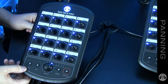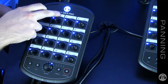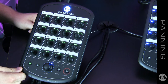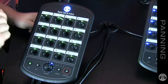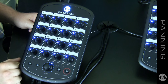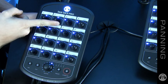The pan button on the Hearback Pro mixer serves two purposes. The first being stereo-linked pairs of channels — this can be done with adjacent channels such as 1 and 2, 3 and 4, etc. To stereo-link channels, press and hold the pan button until all the lights blink green. Now grab and turn one of the two knobs that you want to hard pan left and right. You'll notice that one went hard left and two went hard right. To exit pan mode, simply press it twice and you're back to volume control. When you adjust the volume on either of your stereo-linked channels, you'll notice that they track in unison.